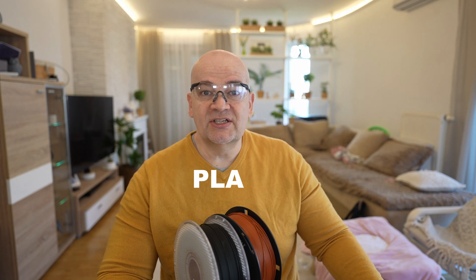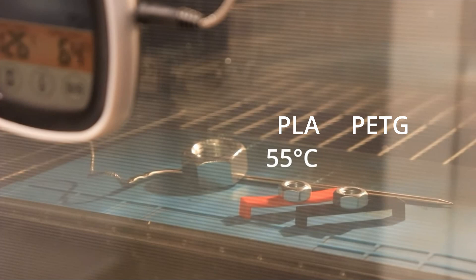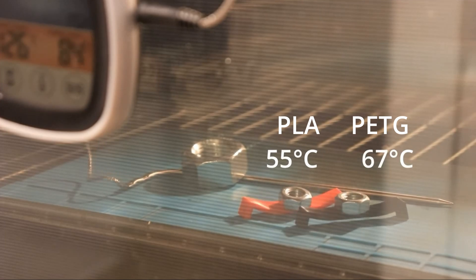Welcome back. If you follow my channel, then probably you know that PLA is actually a very strong material, but it has one very big weak point, and that's the temperature resistance. On 50-55 degrees Celsius it will start to deform. This means if you print something for your car, on a hot summer day it will deform in less than one hour. Now with annealing we can help with this and the temperature resistance may go up far above 100 degrees Celsius, in some testing even up to 150 degrees Celsius. But what is the problem?